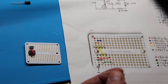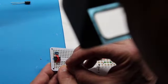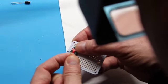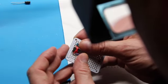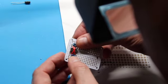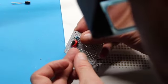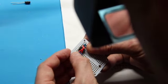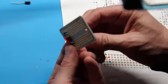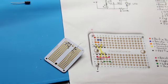Okay, so we're on this row D, which by the way is the same row as the ends of these jumper wires are. So it just bookends those jumper wires. It's on either side of them. Okay, so going to lift him up just a little bit because we're going to use that C row. I don't think it'll interfere at all, but just bend these out. Let's get those guys soldered up.